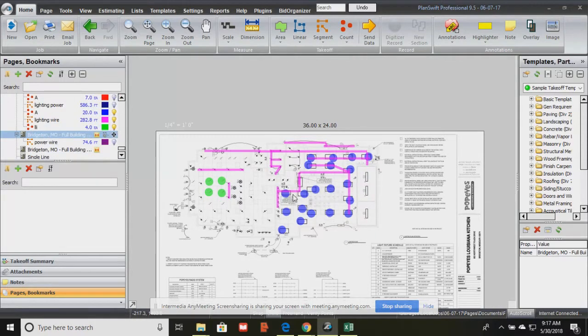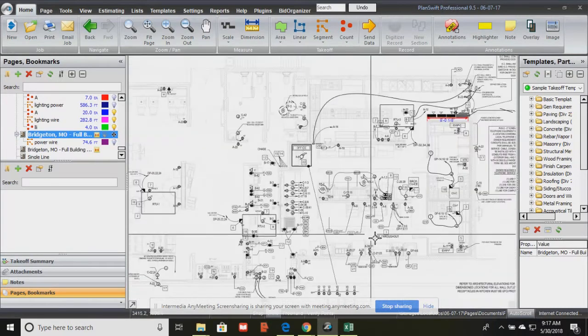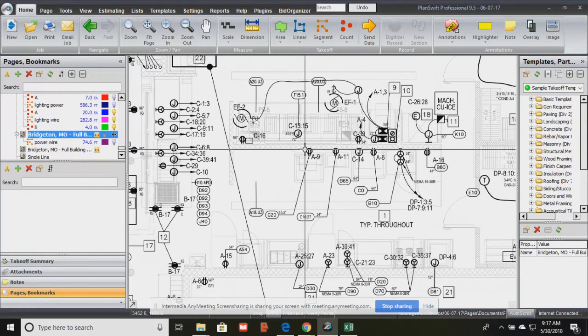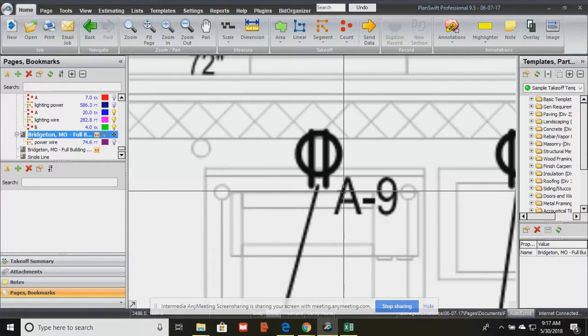All right, so the next set, which is a little more complicated and has a lot more symbols, is the second plan in the set of electrical, which is the power plan. It's going to tell you all about your powering devices. Powering devices are those things you use to power up stuff. A powering device is an outlet, right? We've got duplex outlets as opposed to quad. This is representative of a duplex outlet, basically the outlet you have in your wall. You can plug 2 things in. If it has 4, that's a quad.